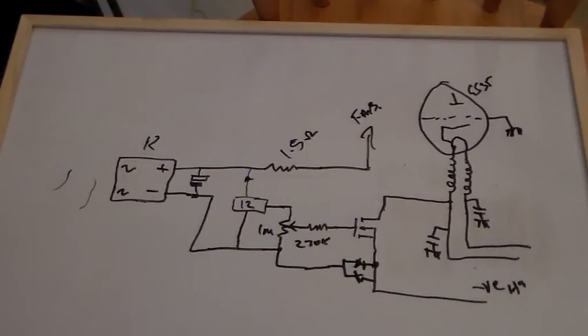All I was doing by replacing the triode with the car lamps was just to make sure that I could adjust the gate bias on the FET — turn the voltage up and down and pass the sort of current that I was interested in passing. So that's it. I hope that made some sense. Thanks for watching, and I'll catch you next time.